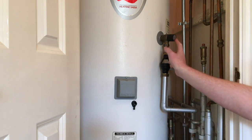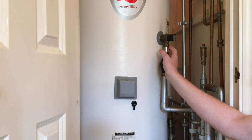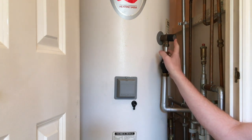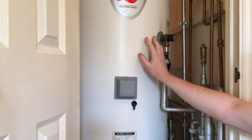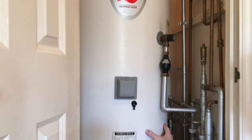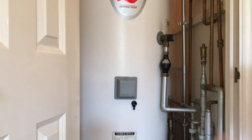What we need to do is open up the tundish valve — this is the tundish, this is a pressure release valve, a safety valve designed to release water from the tank if the tank ever exceeds particular settings. In this case it's a pressure setting and also a temperature setting. I think this is set at 10 bar and a temperature of around 90 to 95 degrees. Your hot water tank is typically around 60 degrees — that's what most central heating systems are set at, some go to 65. These things are very dangerous and you need to be an authorized plumber to handle these systems, hence why I didn't change this part myself — I got a heating certified plumber who is able to work with a system like this.